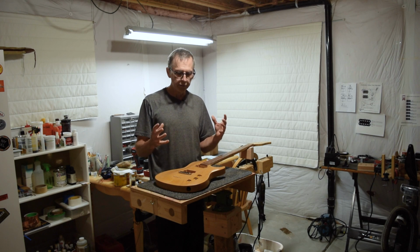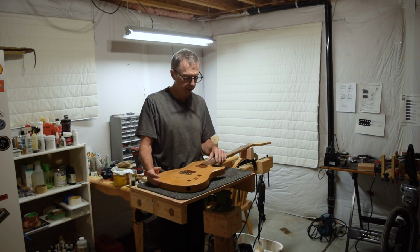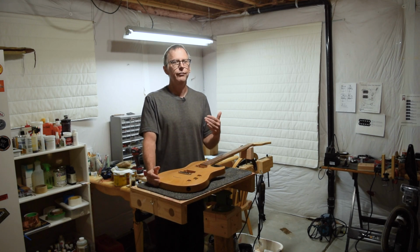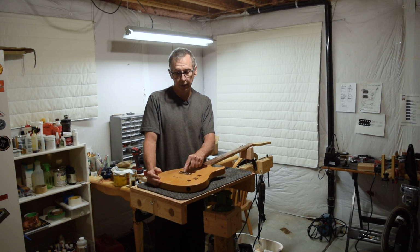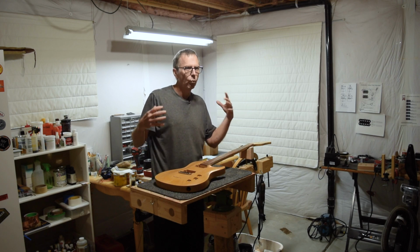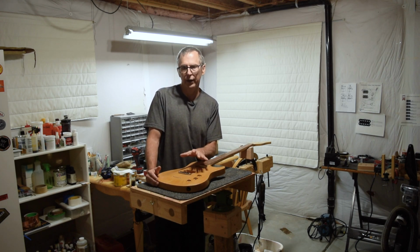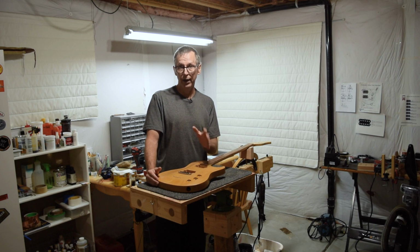All right, guys, well, that is basically why I recessed a Tune-O-Matic bridge and then how I actually did it. And I realize not everybody else has a CNC machine, and you may have to use other techniques to do it. But I think the main point of this video is there's really no reason why you can't recess a Tune-O-Matic bridge. It works just fine. So if it's something you've been thinking about and wondering if it's worth considering, absolutely. If you've got a guitar with a flat neck and you're not sure you're going to be able to get the proper amount of string action with a Tune-O-Matic, I think recessing it is definitely a viable alternative.